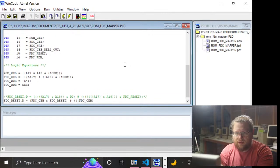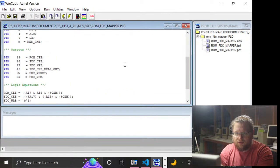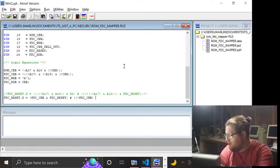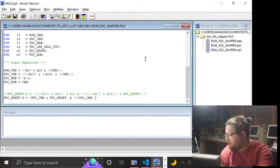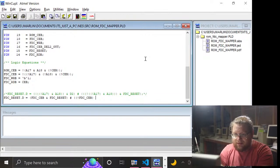Ooh, also we have to get the read-write working here, because we actually are getting a read signal somewhere, and we're running it to the chip, I think. And right now this is just going to toggle on any access to that memory address, but we really would like to be able to write to that chip. So, yeah. We will do that tomorrow, though. For right now, let's see if we can toggle this thing.